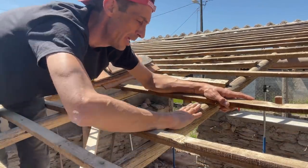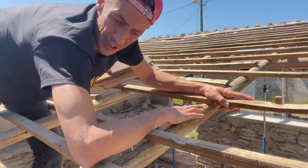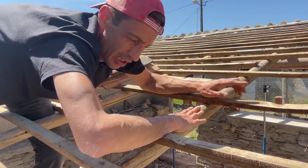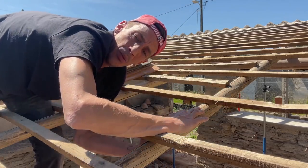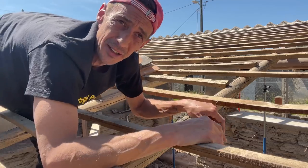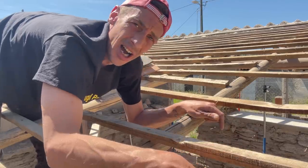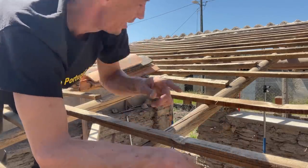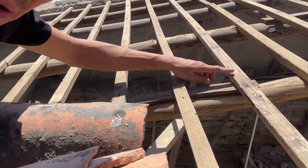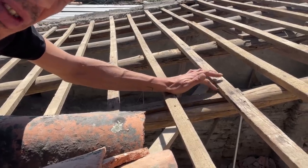Now what I want to do is make... what's this called again in English? Put cladding first on these rafters, so you look to a nice wooden surface on the inside. This is a little different than with the new rafters on the main house, because all those rafters are exactly on the same height. So here you see already sometimes where they filled it out, because for the battens it was coming too low here and it wasn't reaching the rafter, so they filled it out.